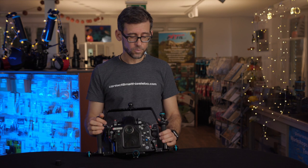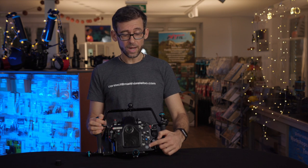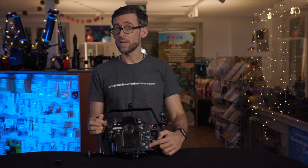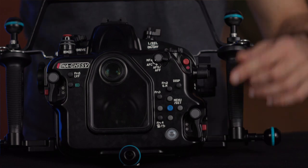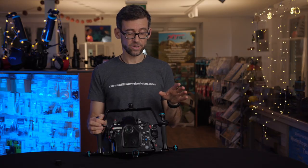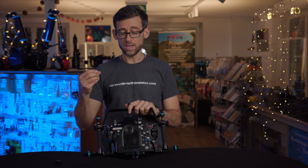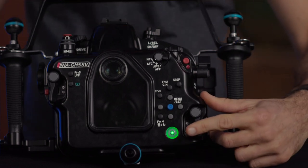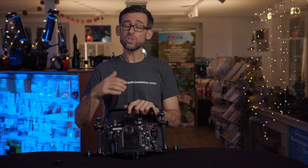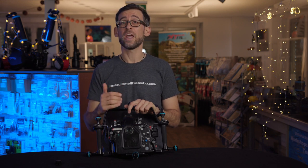If pressure doesn't stay stable, there's a little LED light at the bottom. Once activated, it flashes in different colors. Blue means ambient pressure — that's the normal startup color. When you start sucking out air it turns flashing yellow, and it will go solid green once it has established integrity and under-pressure inside the housing. It should stay green throughout your entire dive.